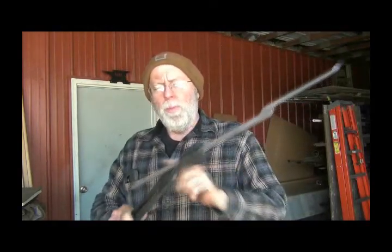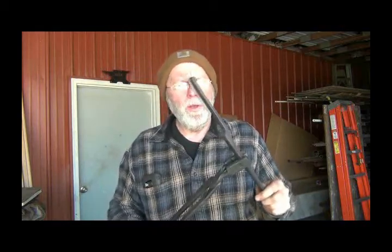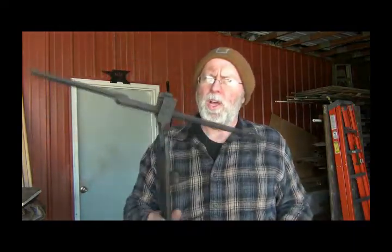I'm kind of proud of them. I'm not real happy with the rivet - I've still got to learn how to do that - but they are tight and they do work. That's the main thing. I made these tongs as tong-making tongs. They will hold these blanks and they will pass by like that, that's why they're on an angle. So you can grab them clear up here if you want to, and they have grooves on the side so you can grab them from the side and they will hold pretty good - good enough to do the job.